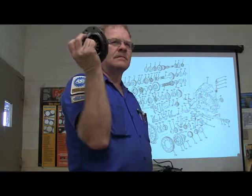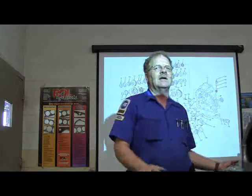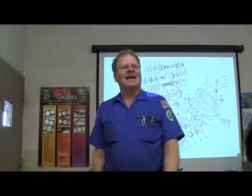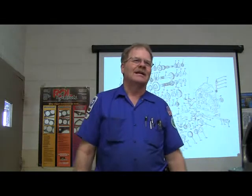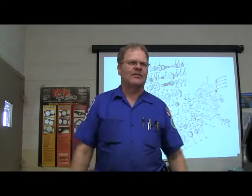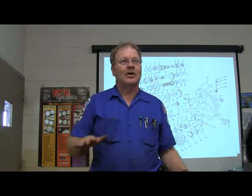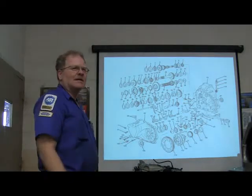To move the rotation from this way to that way. The reason it has to be on there is because if you're making a curve, the inside wheel is turning faster or slower than the outside wheel. If you're going in a curve to the left, the inside wheel is going to turn slower than the outside wheel because the outside wheel is covering more ground. I had a guy in here one time who was always racing his car. He welded those spider gears all together — which is what people do for positive traction so they won't have one wheel spinning. But whenever he made a curve of any kind, he was actually spinning one wheel and dragging the other. That's what those gears are in there for.